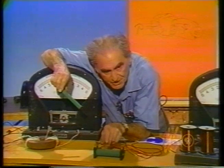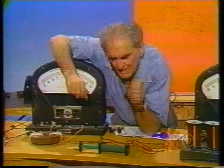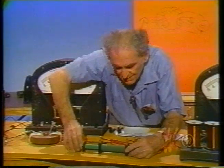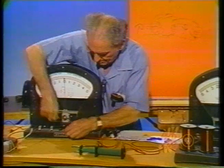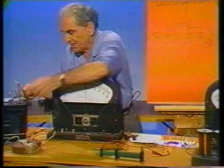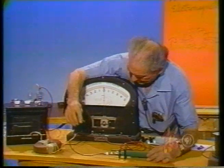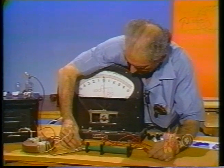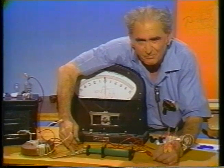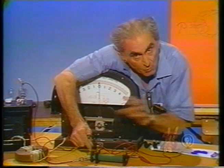A little more of the same, which is very exciting. Here is a coil of wire of so many turns, and here is another coil of so many turns. I am going to put this coil inside of that one, and the degree to which they are coalesced we call the coupling. I am going to connect the outer coil to this meter, and then connect the inner coil momentarily to the battery. Watch the needle. The deflection is feeble — the coupling is very poor, the induction is not so good. Let me increase the coupling by having the inner one more inside the outer one.